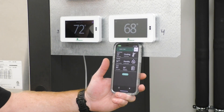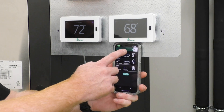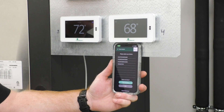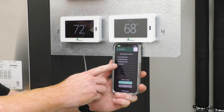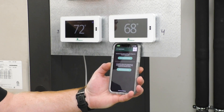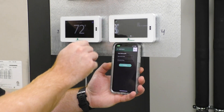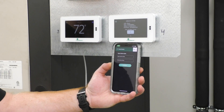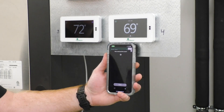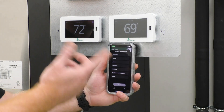From there, go to either the Google Play Store or Apple App Store and download the My Uplink app. Once the app is installed, create an account. To add the thermostat, click on the top bar and click 'Add System.' From there, find 'Connected Devices.' With the serial number you photographed earlier, you will find it pop up on the list. If you don't see the serial number on the list, you can enter everything manually — hit 'Enter Manually,' fill in the connected details, input the serial number and the connection string, both of which appear once the thermostat is connected to a hotspot or router. Once it is connected, it will appear as a blank screen. Go in and add what the homeowner wants to see — whether it be temperature, humidity, or system status — and choose which options to appear on the home screen.